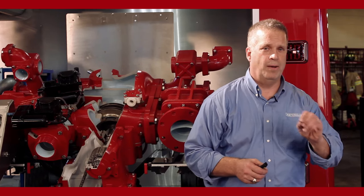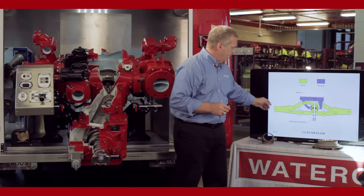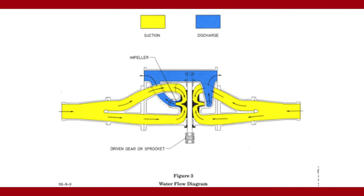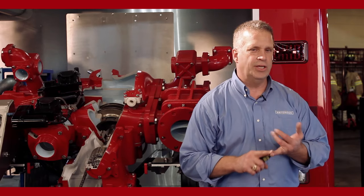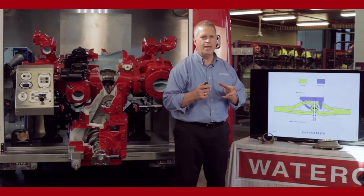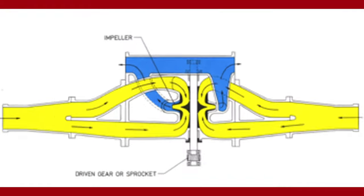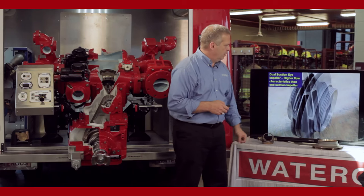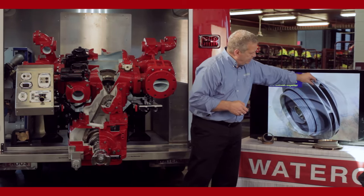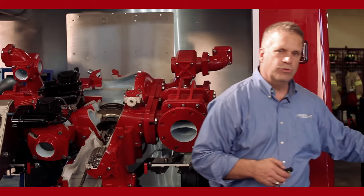That's the theory of a centrifugal pump multiple stage. The single stage pump uses just one impeller — same basic pump body design with an intake fitting, where water splits apart and goes to the eyes of a dual suction impeller in the middle of the pump body, turned by the same style of impeller shaft. But it doesn't have a transfer valve and it doesn't have flap valves. You get whatever pressure you can create by RPMs — how fast you can turn the impeller. Water comes off one side past the stripping edge to the discharge, and off the second side to discharge as well. This is a dual suction impeller — water comes in on either side, feeding either a split shroud exit or a common exit way to flow high volumes of water through a relatively small impeller.